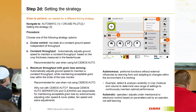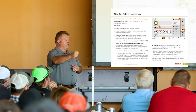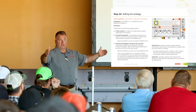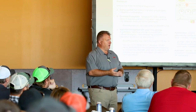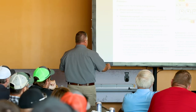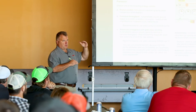You have cruise control, which is great when everything is nice and consistent out there. You're harvesting corn, you might be wanting to push the combine harder or try to get more throughput out of it than the pressure roller in the feeder house will allow — that roller that runs across the feeder house halfway up between the chains. If you get some really high volume crop in there, you might push it to its limits. So to override that, we can switch to cruise control and override that.